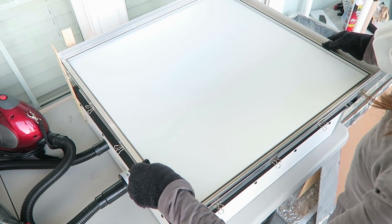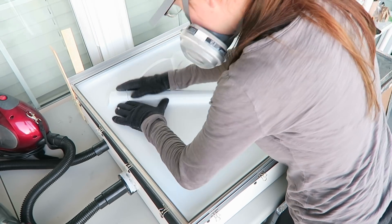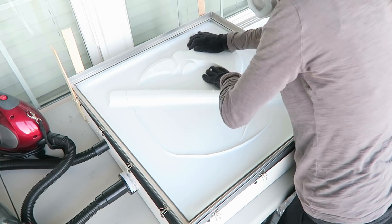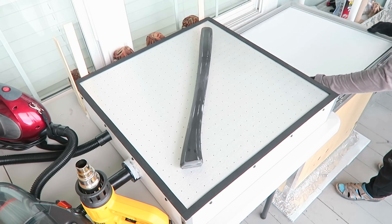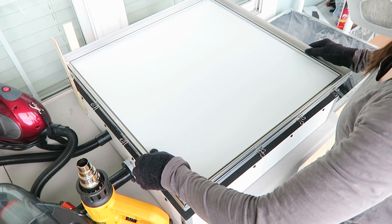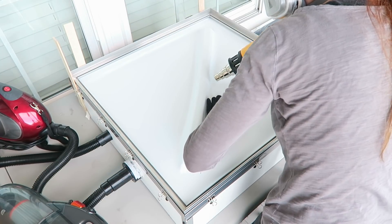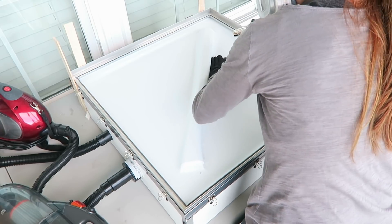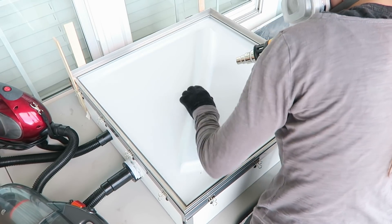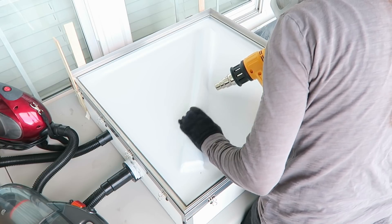This was my first attempt at vacuum forming, so it's not surprising that it's not going as well as I hoped. I think it was too hot the first couple times because it wrinkled up, but it still didn't suck in around the base or against the center of the axe head. This is 0.03 inch thick styrene and it cools so fast that there doesn't seem to be time even to help it with my gloved hands. The heat gun kind of helps, but the result is messy and it's easy to melt through the plastic by mistake.